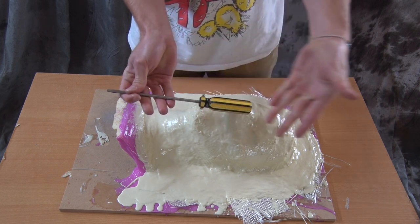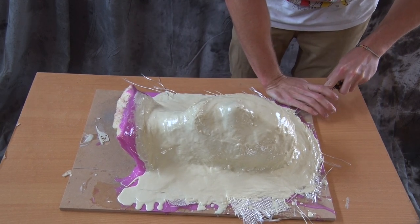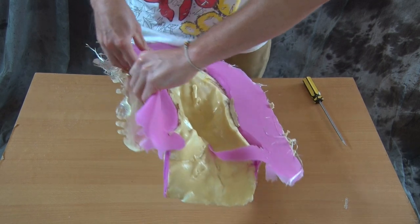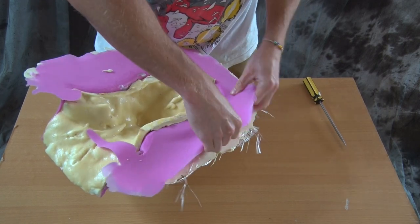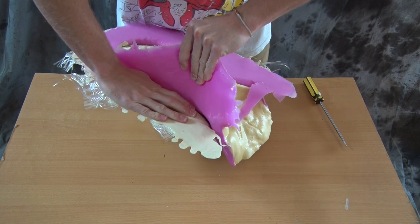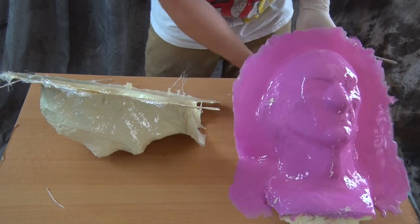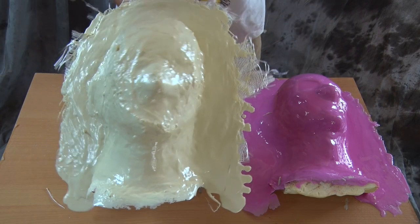Here we are all dried the next morning. I've got my screwdriver and I'm going to pry the entire thing — the fiberglass mold, the silicone mold, and the clay sculpture — from the board for de-molding. We've got everything off the board, so now it's time to pull this baby apart. I'm being as careful as I can especially with those fiberglass particles still remaining. Everything is airtight so it's going to be a little hard at first, but voila — out she pops. There is our silicone mold still adhered to the clay sculpture, and there is our fiberglass mold that needs some cleaning up to get rid of those exposed fiberglass cloth edges.